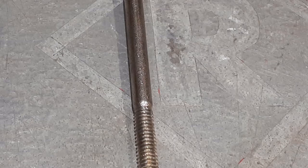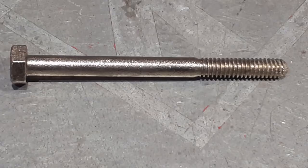It's worthwhile noting that not all metal objects will plate the same. There are a significant number of well-documented adhesion problems. However, the majority of these deal with the base metal composition. I found that the purer the iron, the better the result.